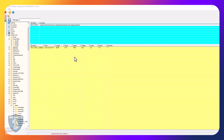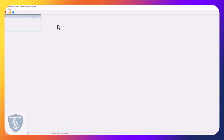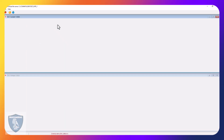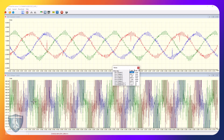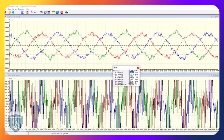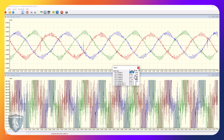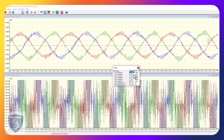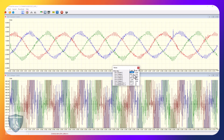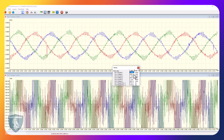Boom. You also notice down here, ECMS 320081 is there. So while I'm in here, let's go ahead and see if we can see data. Yes, we can. And this is going to give me some problems. Look at that, 26. It's done the same thing for some reason. It's giving me 10 times the voltage. So that, of course, is a little off.